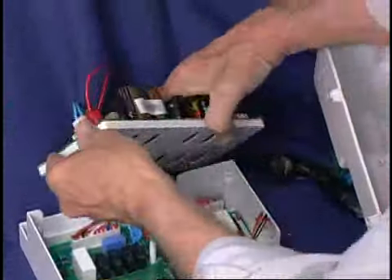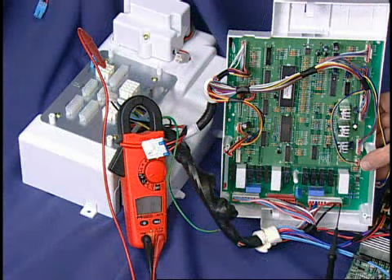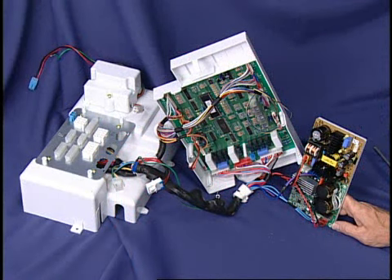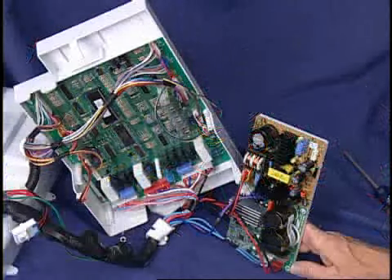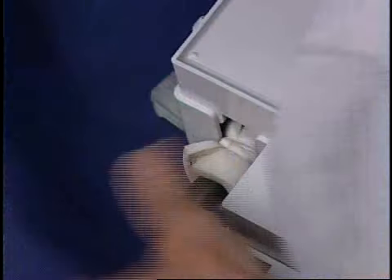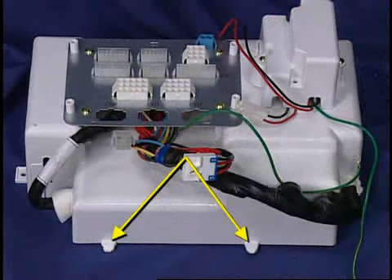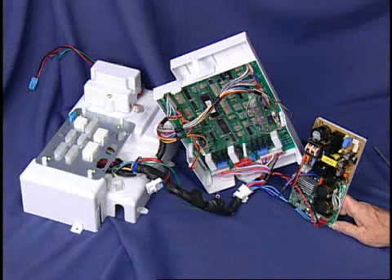With the two boards removed, the main board is accessible — there are four screws holding the main board to the housing. With the board compartment removed, checks can be performed on the wiring connectors. The only purpose for accessing these boards is to verify there are no wiring problems between the terminal block and the boards, or between the SMPS, inverter board, and the main control board. When reassembling, make sure the foam wiring protectors are back in place. Use the locator tabs to lock the bottom of the assembly into the compressor compartment. These boards have historically had very few service issues and low failure rates — be sure to troubleshoot the components properly before condemning a board.